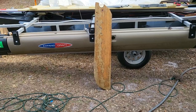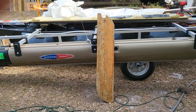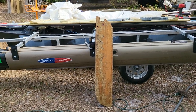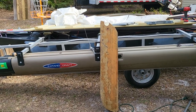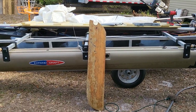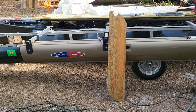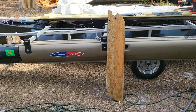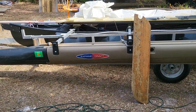And there's something else I'll show you — ta-da, like magic, it's here. That is a wood swinging centerboard that I could mount right there on that center rail, and it would swing down and give me a deeper and more efficient center of lateral resistance, CLR.